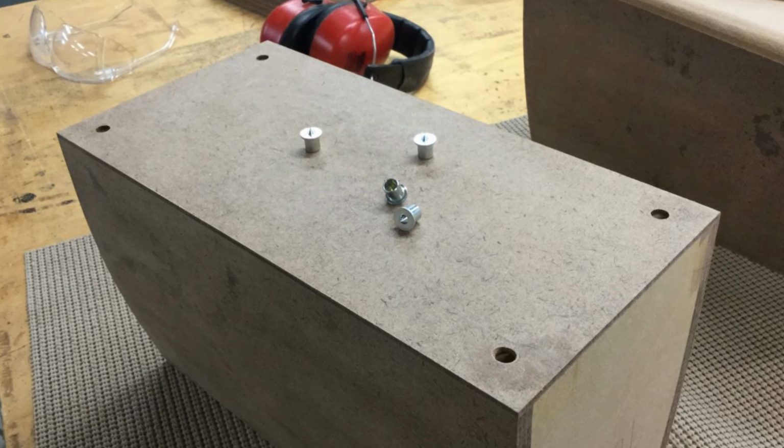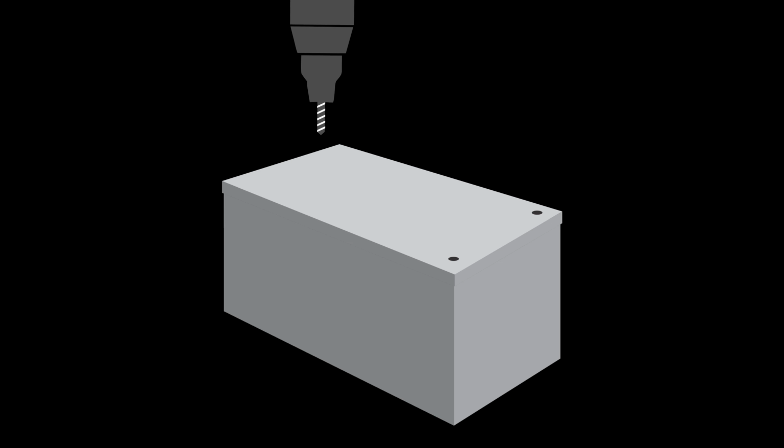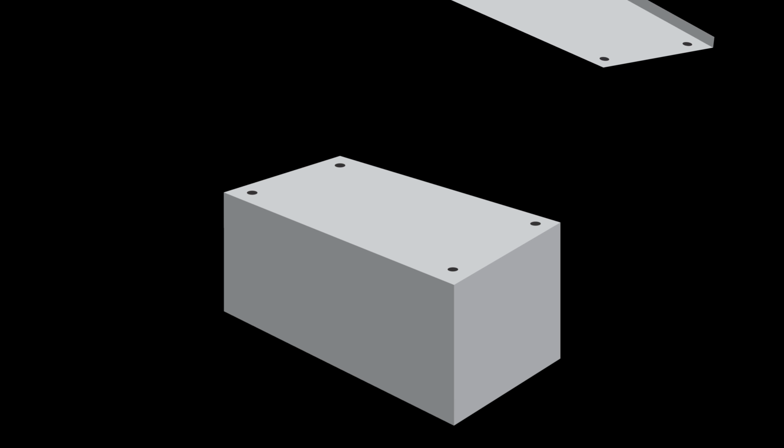If you don't have dowel centering pins or don't feel like spending the money on them, you could place the grill on the cabinet after marking the hole locations on the grill, and then drill through both at the same time. You may need to fill in some material on the grill and fiddle a bit afterwards with the proper depth on each cabinet hole, but that is another option.